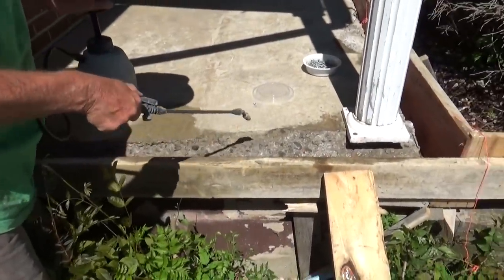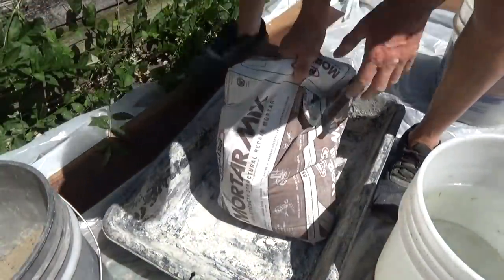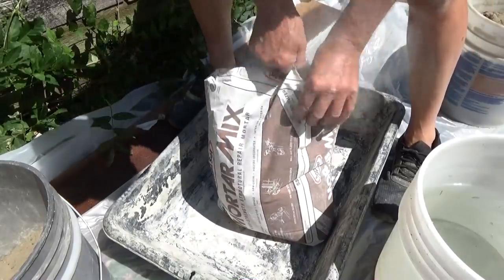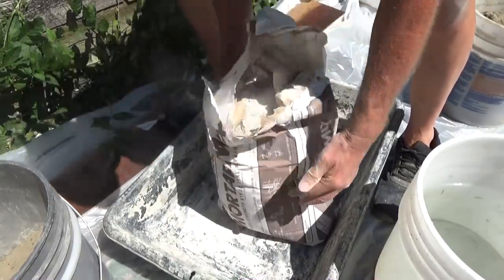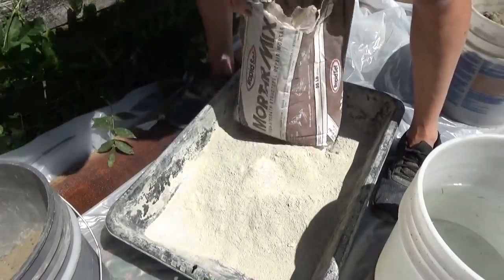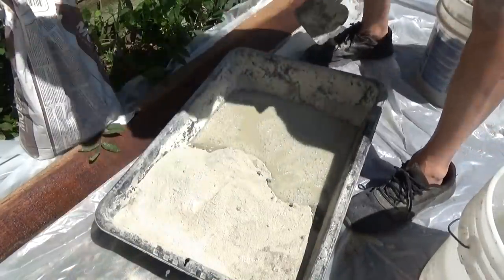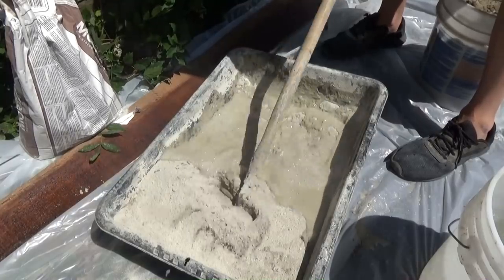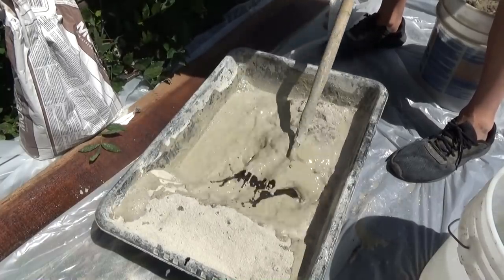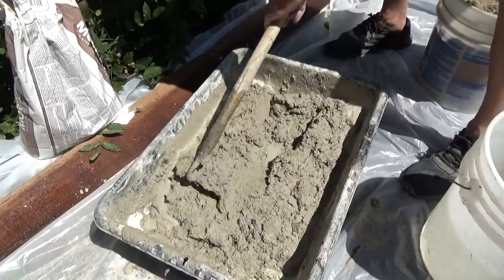What I'm doing before I even mix the cement is I'm wetting it really good. Today I'm just going to use rapid set mortar mix. It's good enough for this job. It's going to dry fast. You got to work it fast. I mix a little bit at a time. Now I'm mixing it up. Now this stuff dries fast, so my helper there, he keeps it wet. So that's the consistency that I want, right about like that. I gotta work fast with it.